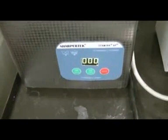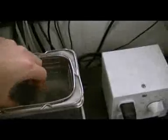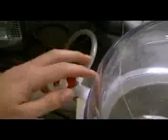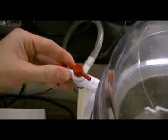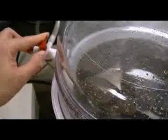After we clean the porous stones, we can take them out and store them in our vacuum container. Let's transfer the two porous stones into our vacuum container. Release the vacuum and open here — so there's no vacuum inside the vacuum container. Take off the cap and put the two porous stones inside the water. Put the cap back on and make sure there's no leakage between the cap and the tank. Put back this bolt and turn this to the vacuum source, so the vacuum will hold the cap tightly.